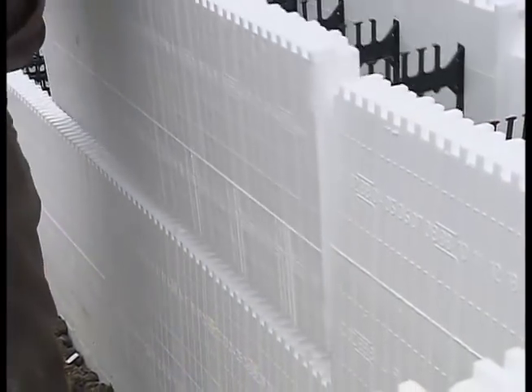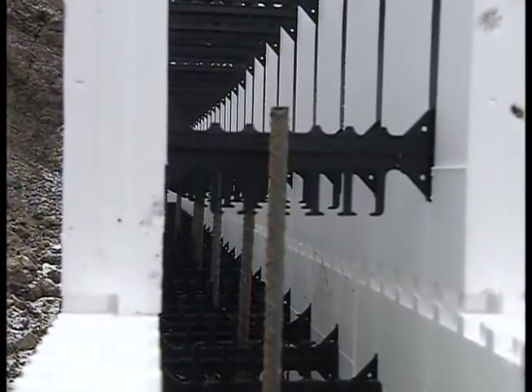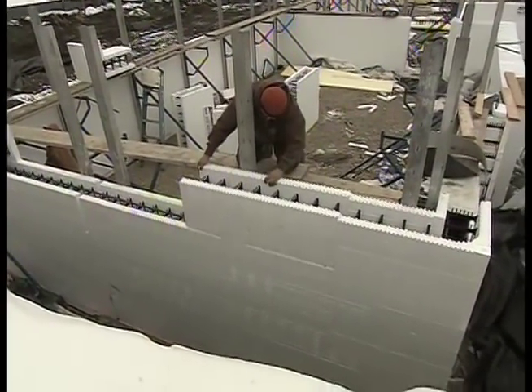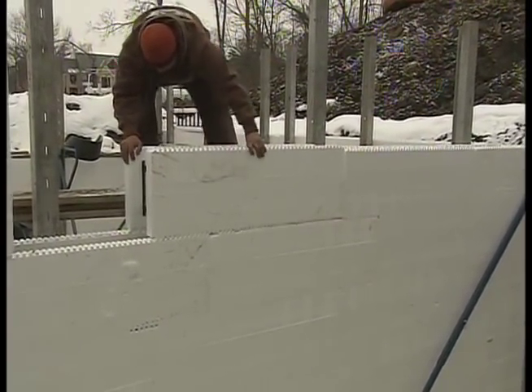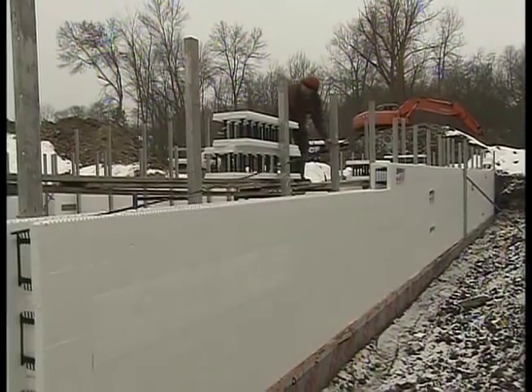Some of the early, first-generation forms were very thin foam and very weak. The standards today have really raised the bar with construction. You need the flowability of your concrete, and they all should be internally vibrated with low-impact vibration — honeycombing is generally not an issue once you understand the properties of the pour. If you're going for a LEED-certified home, how does something like this help? Oh, immensely — I believe it's about 26 points that we contribute to the LEED value, so it's very easy to get that certification using these type of walls.